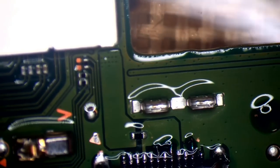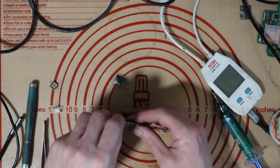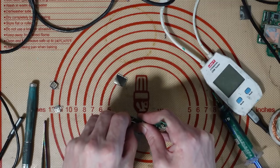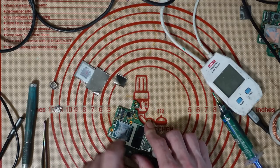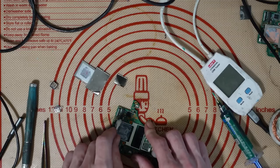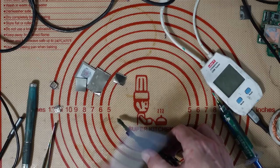It's not perfectly aligned by any stretch of the imagination, but it'll do the job. That looks a million times better. I'm going to remove the shields — I spilled coffee and I'm not going to risk it. I'll also clean up the thermal paste, which I do before selling these anyway, so I might as well do it now. I'll also clean inside the port because flux will make its way in there.